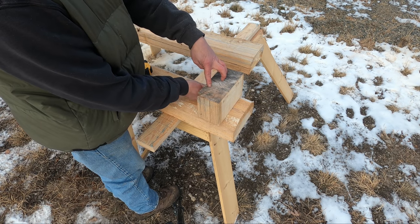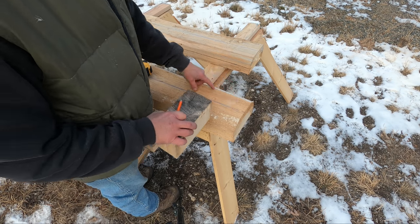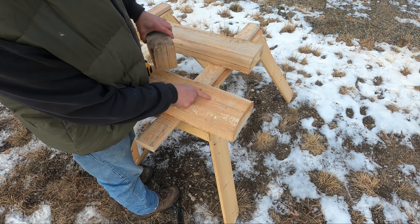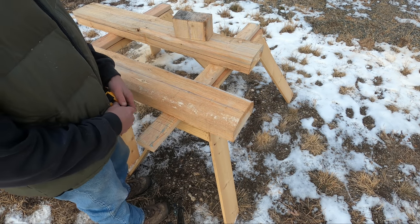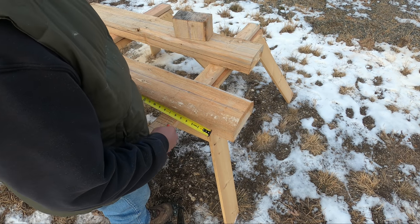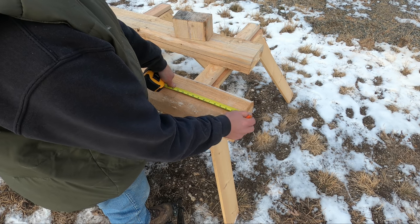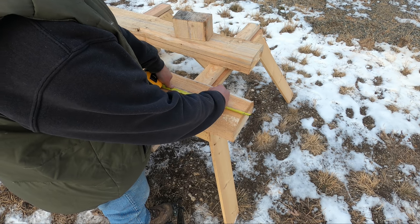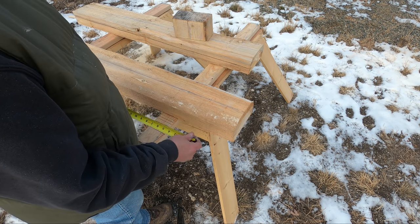So this is where my cut's gonna be. Got my 2 inches overhang plus my wall thickness. Put a mark here. You can see this mark. So that's not exactly my layout. The jig is offset 1/4 inch from this line where the saw cut's gonna be. So I wanna cut there. I'm gonna back up to my left 1/4 inch. And that's my layout starting point.